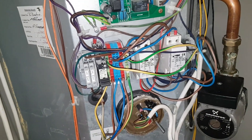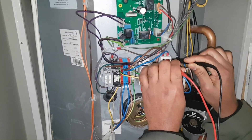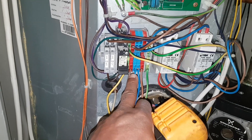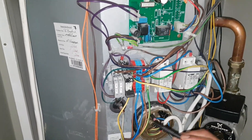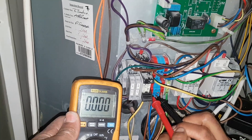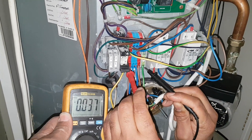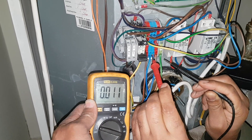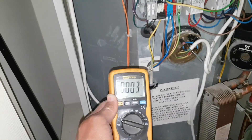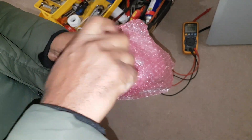We're going to change the relay over and then you'll see what we've done. We're going to make sure the power's off — we've turned the power off. Here is your feed coming in, so go across these two wires, live and neutral, and do your polarity check. Check live and earth — that's off. Then neutral and earth — okay, so we know the power's off, it's safe to work on. Always work safe. I buy them in pairs like this but we'll just use a single one today.